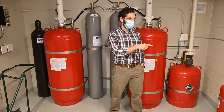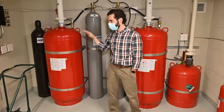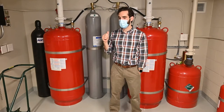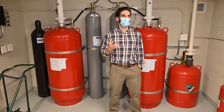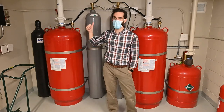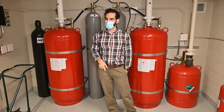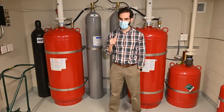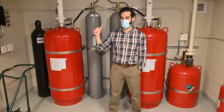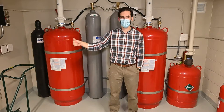When the VESDA detects smoke, it sends a signal back — it'll send a general alarm and let everyone at the central monitoring location know this system is sensing something. People can come up and check it out. If the fire continues to grow and sets off a regular smoke detector, the smoke detector plus the VESDA will put this system into pre-discharge. Horns and strobes will go off — you'll have 30 seconds to leave. After those 30 seconds, the system discharges. There are abort buttons — if you press the abort button and hold it, it stops the system. But it's on a deadman switch: if you let go, the system will discharge.